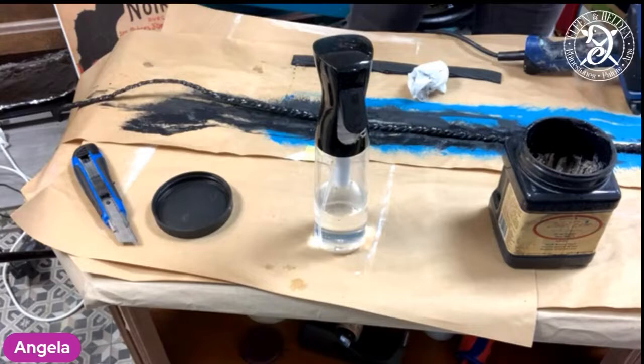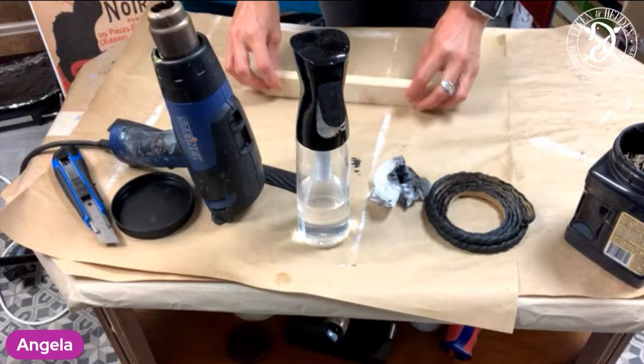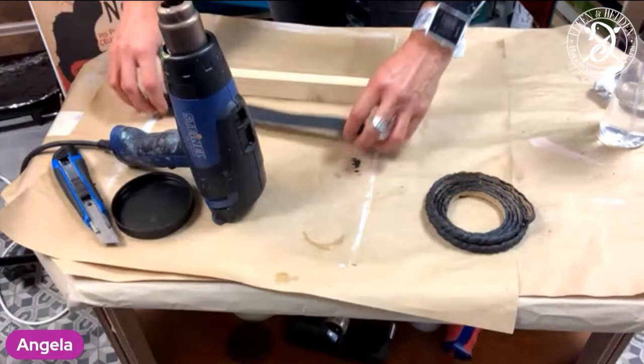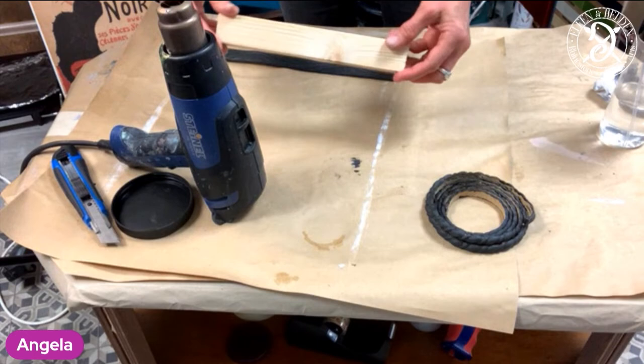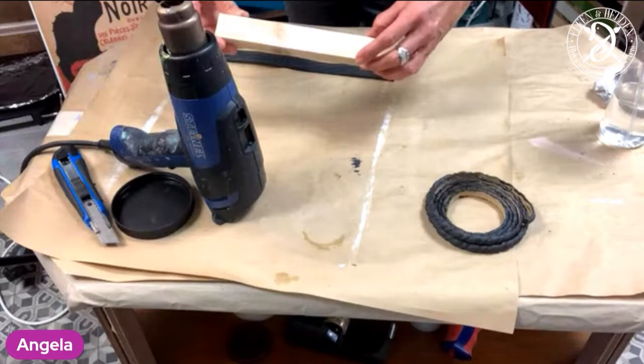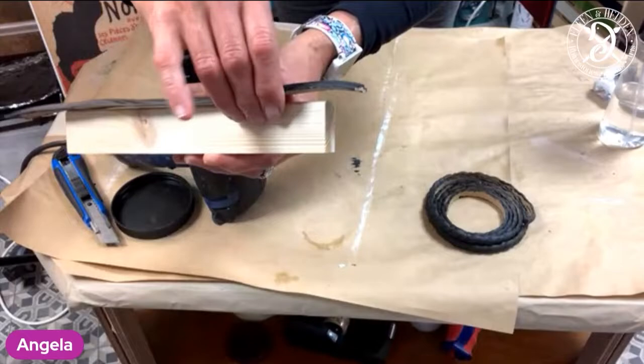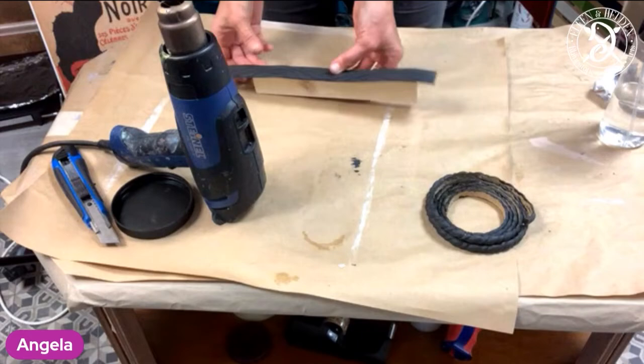And applying the WoodUbends to your project, you use wood glue of a good quality, and it doesn't matter which surface it is. If you apply it onto glass, wood, metal, plastic, whatever, you always use a good quality wood glue. Here I'm using this piece of wood which I'm going to make into a little shelf on the keyboard. And I'm using the trim 719, which overlaps it a little bit to make a little step, so everything placed onto that little tiny shelf will not slip down.